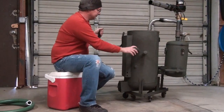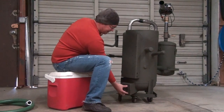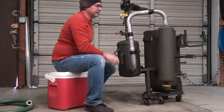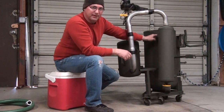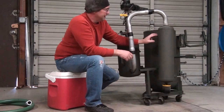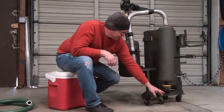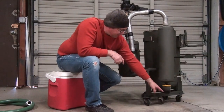I also built a clean-out: simply unscrew it, pop it out - that's a four-inch plumbing cap - screw it in, pull it out, clean everything out. That's my reactor. Going around here to my cyclone filter - this was an air tank called a hot dog tank. This pipe goes directly into the top of my combustion chamber reactor. I cut an oval shape here, just like Josh did, and his videos show really well how that works. The gas at this stage is cycloning through here.